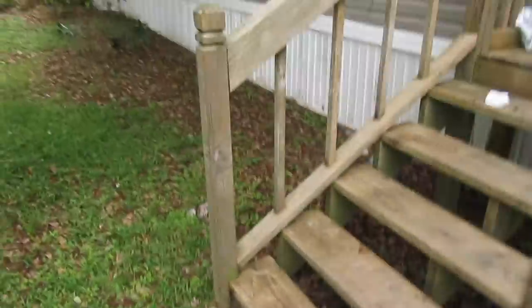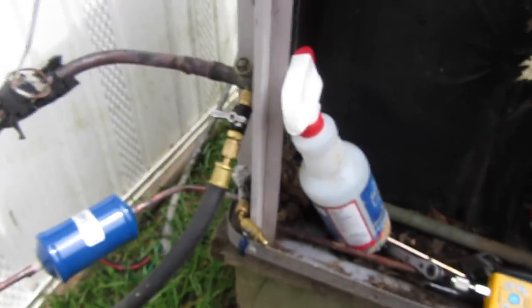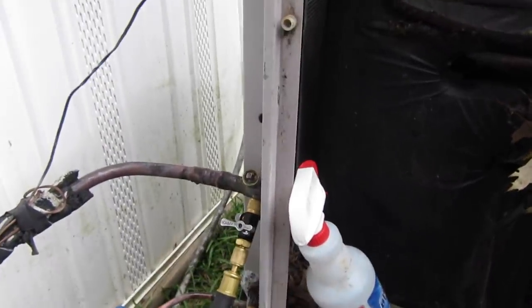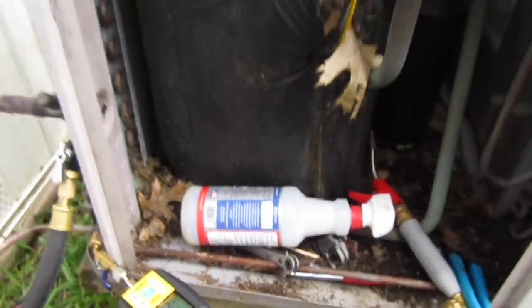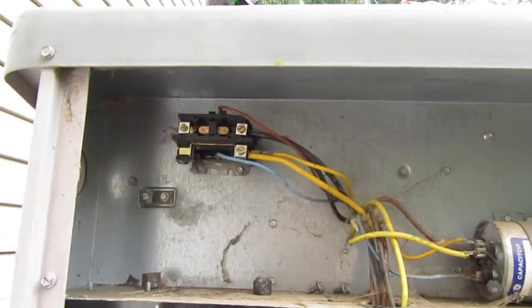She said they bought the mobile home used from a dealer and their AC guy changed the indoor coil - the brazing did look pretty sloppy. So we're going to check that. There's the old king valve - we'll have to nylog it and tighten it up. Everything looks good inside, the Schrader's good, the braze joints are ugly but they're good. But you can clearly see that's an issue. We'll have to nylog that up so we can get a proper vacuum. We nylogged both of them just for good measure and within seconds, less than a minute, we're already down to 1543 microns.